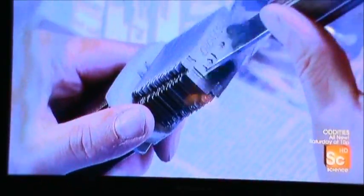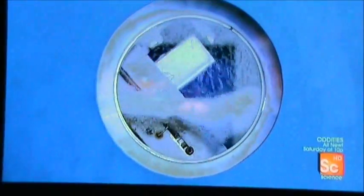Then every single blade the factory produces is examined for cutting edge defects. Technicians assemble blades in packs of up to 800, then shine fluorescent light on the two cutting edge sides — this makes defects visible. Blades that pass this inspection are washed with solvent to remove contaminants.